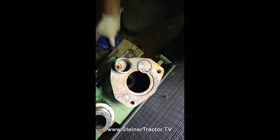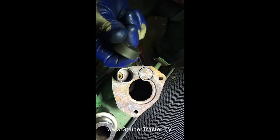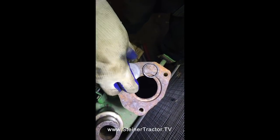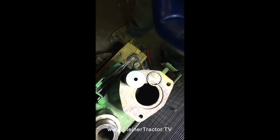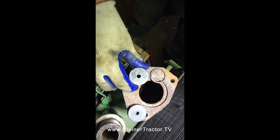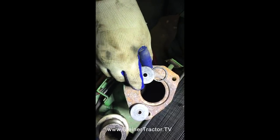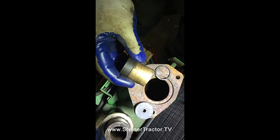And then we took one of our bushing drivers. This one is 1 inch and 7/16, actually, the next size smaller, so it'd be 1 inch and 3/8 is the one that we used. And then from the top, we drove the bushing down with the help of this driver until it fell out of the bottom, and it really didn't come out very hard, thankfully.